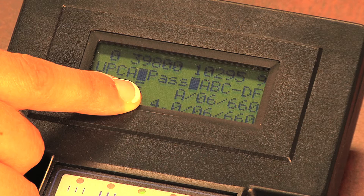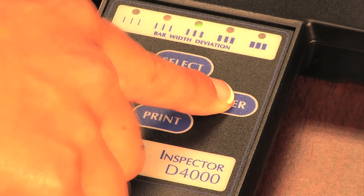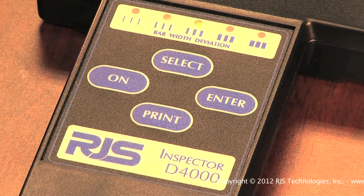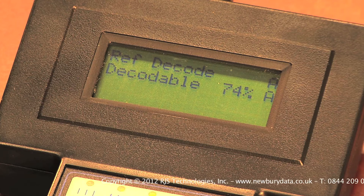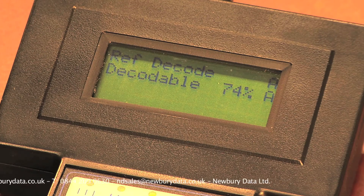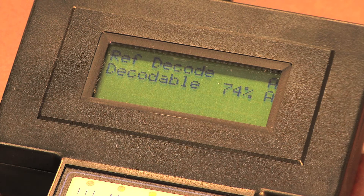After reviewing the general information, if you would like to learn more or troubleshoot your barcode, you can press the Enter button, which will toggle the system into the results viewing mode. This mode will allow you to cycle through various results by pressing the Select button. On my verifier, the first results display are Reference Decode and Decodability. Reference Decode is the most basic barcode check and is pass or fail. It includes checking the barcode pattern, that all the bars and spaces are valid, valid check digits, etc. Decodability is the accuracy of the bars and spaces when compared to their ideal widths. You will find a percentage and a corresponding letter grade next to Decodability — this is the inspection result for this parameter.